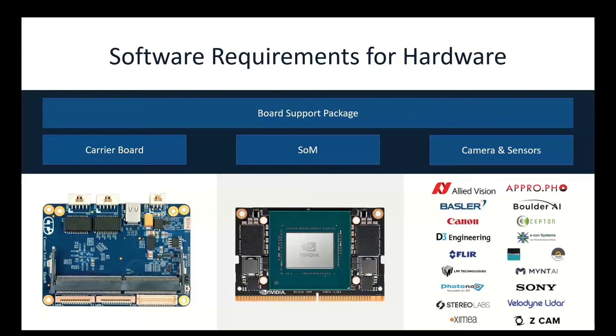In many cases, companies are focused on their AI inference, algorithm improvements, and system efficiency — and it's in this focus that the need for additional low-level driver and kernel-level modifications becomes apparent. A board support package, or BSP, connects discrete hardware peripherals to the application-level software executed on the NVIDIA Jetson. This is the bridge between your sensors and your application-level algorithms, inference, and other models being processed by the GPU. Drivers and configurations for specific camera models need to be built within the BSP. Companies can develop the software themselves or work with companies like Connect Tech to build custom BSP packages across different JetPack versions.